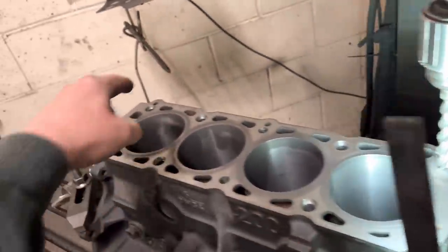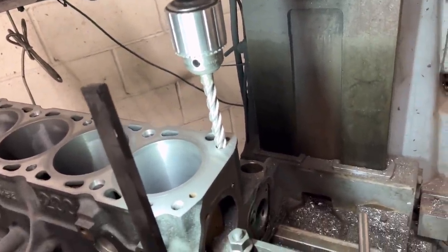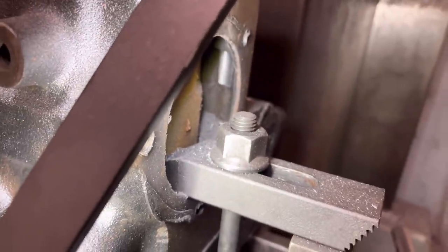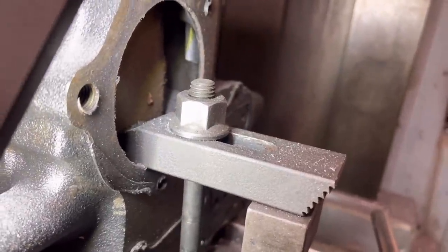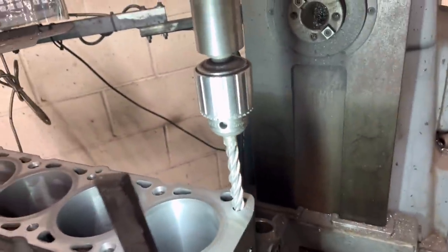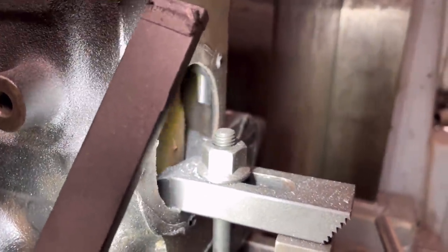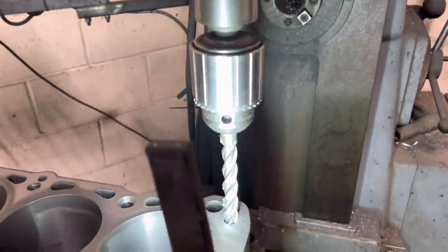What I wanted to show you is one of these two and why it's so important to run the end mill down before you run the drill down, because we've had this before. I've run the end mill halfway down already. That bit of casting that I'm running the end mill down — the other side of that is an oil way. As you can see, if you run a drill down there it would just go off centre, and then by the time you put the stud in the stud would be right on the piss. So we run the end mill down very slowly right to the bottom until it puts a flat on the bottom, and then we can run the drill down — that will assure the stud ends up vertical and in line.